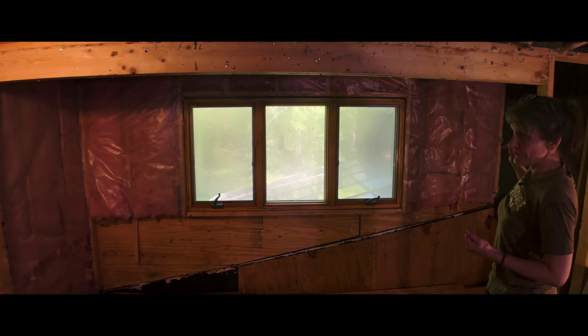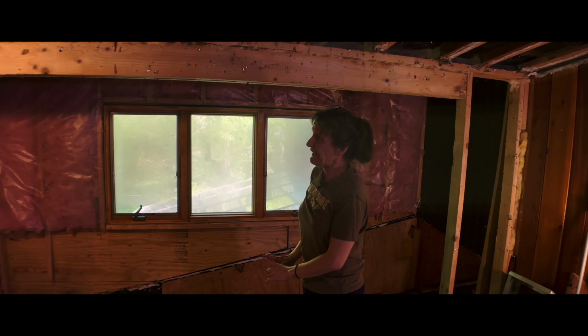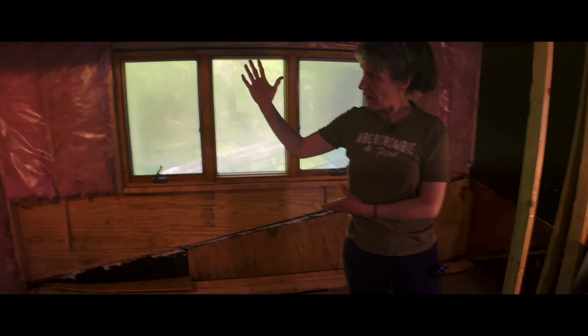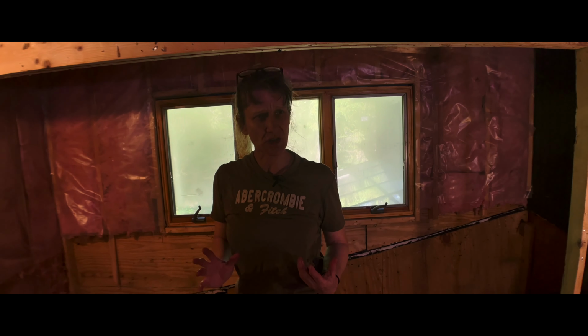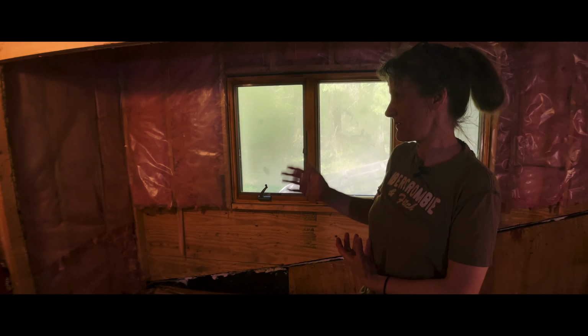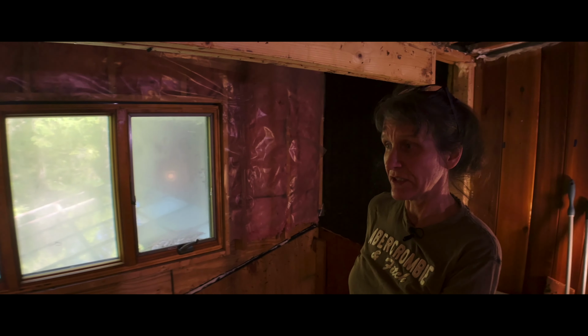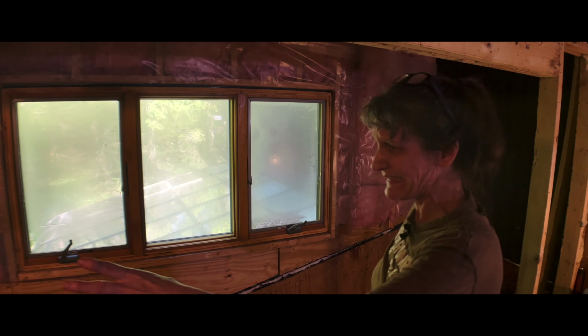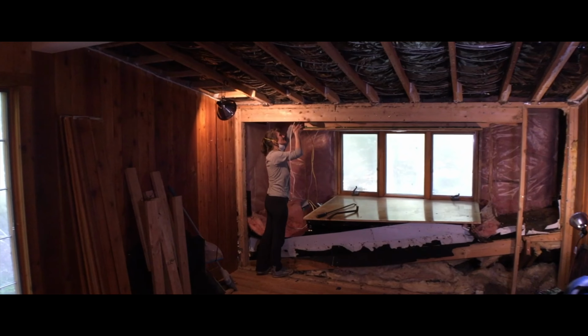What I did was I first took down the paneling that was up here, the wall. Then there was a lot of framing behind it. And this used to be an external wall, I found out. So it was very interesting to try to take out the framing because of how it was constructed. And there were layers of construction because it seems there were several home remodelings that had to do with this space. So once I was able to remove the framing, it exposed the two dead air spaces on each side. There was a lot of insulation in there. There's some videos that I think Chaz is going to be showing about what that looked like then. And there was this window area as well. We got the top, the bottom, and each side removed. There was even more framing behind that.